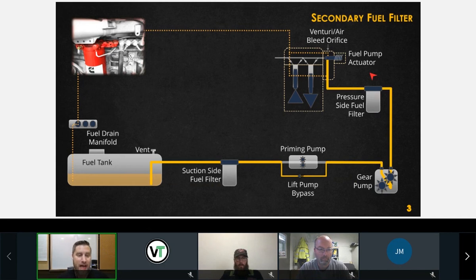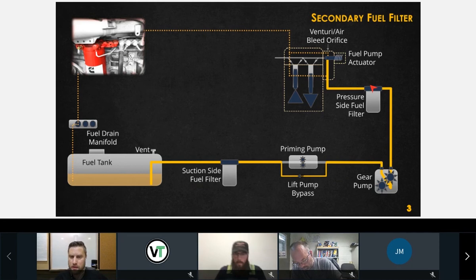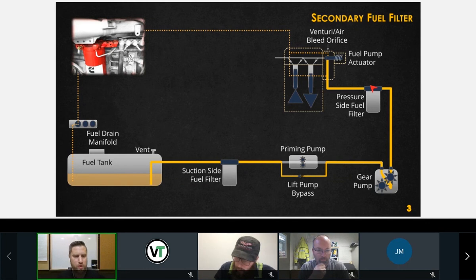And also the filter head is where we're going to do all of our low pressure system diagnostics. That's another important thing. This is where we're going to tap into the system to determine if we have a low pressure fault or a high pressure fault. So that's where that test port is. Like that really common diesel engine test port, the CompuCheck fitting. Yes, that's what it's called. I have a CompuCheck fitting on a big long hydraulic hose so that I can run it up to the windshield if I have to during a road test. And then I have a digital gauge that I plumb into it. Yeah, we'll show you how to do that. Now, tapping into it on a mid-range engine versus an ISX engine, it's a little bit different.